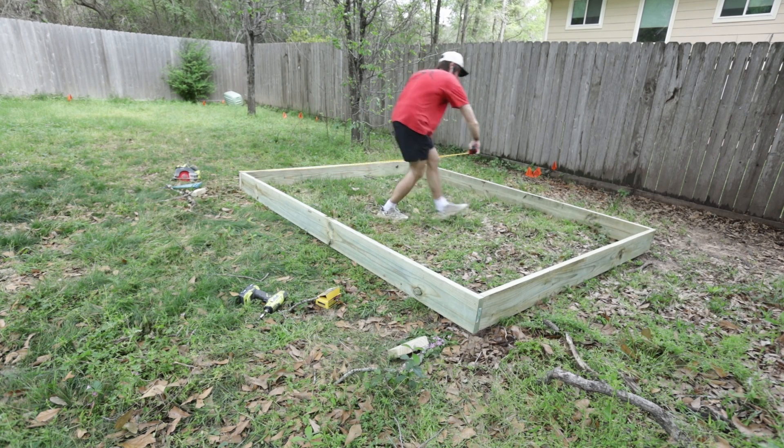Next up, we got our Tough Blocks. Just to be clear, I've never used them before, but I have used a deck with normal footings. People use concrete ones, but they have a problem with wicking up water and ruining your wood. With these, they don't do that. They're also super light — a concrete one I cannot be doing this with — so they're easy to install, and I'm going to show you how.